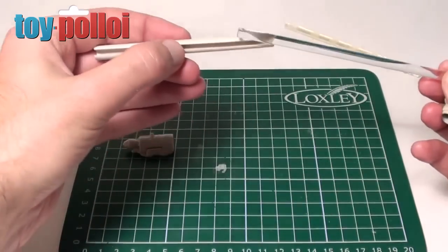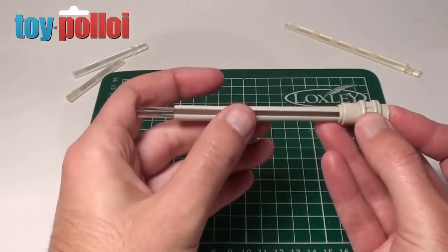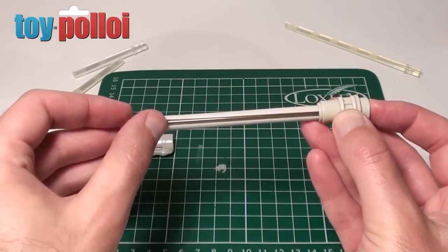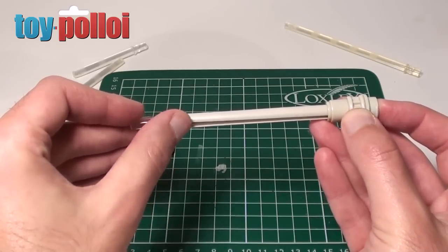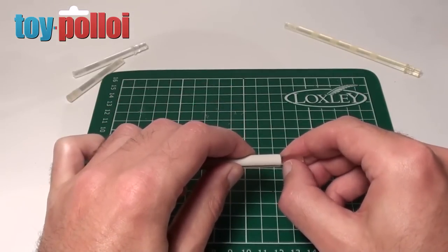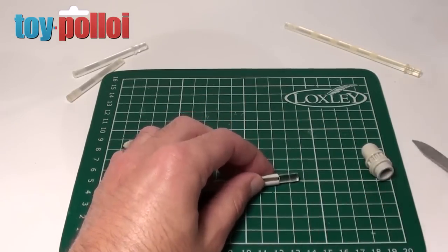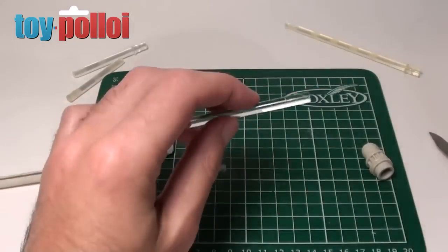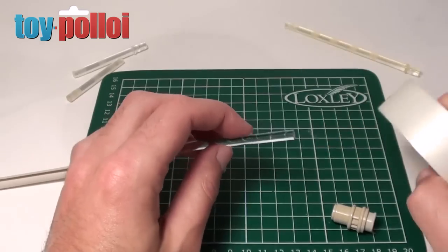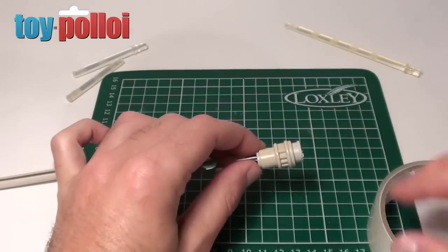The first thing I need to do is line up where the tubes need to go inside. I'll loosely put this together, push the Perspex in until it's at the right size, and push the grey tube in till it stops. I'll pull it out and make a mark on the Perspex, then score it slightly with a knife so I can see exactly where that line is. Then I'm going to wrap this end in clear plastic sticky tape until there's enough that it will stay fixed in place.